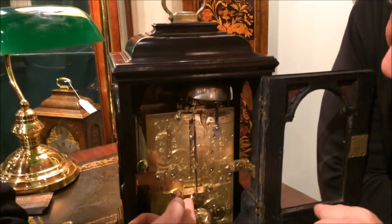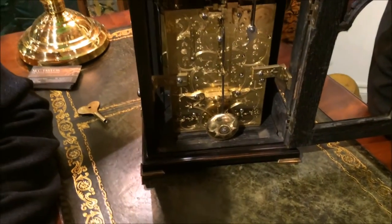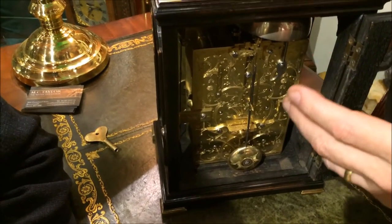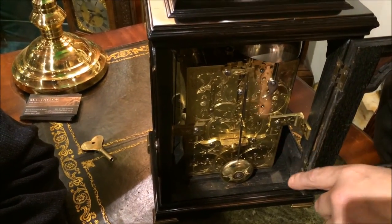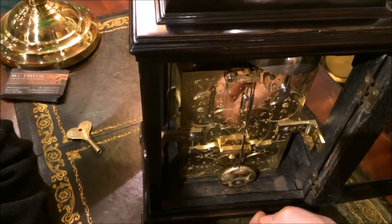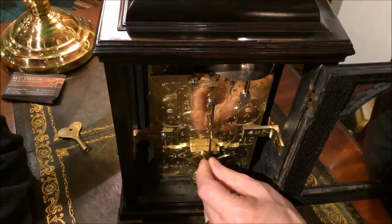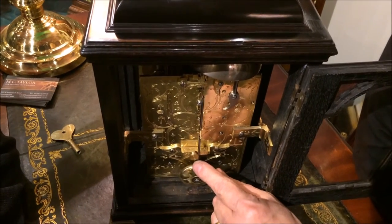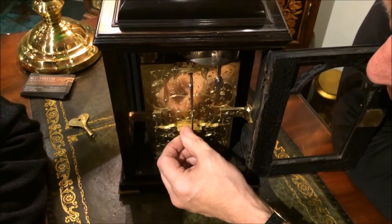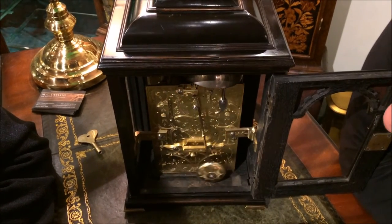What is this, Mark? That wonderful little device. To transport the clock, one usually parts the pendulum, especially with a suspension, so it wouldn't clatter about and cause damage. So this is a locking device. But rather than just a nut that locks the pendulum or a spring, we have here this little weighted block that was swung up into position. That little knob there was unscrewed, the pendulum rod was placed in a groove, and then a nut tightened again — that would hold it firm. When you unlock the pendulum, you just push that down out of the way and then you could start the clock running with its verge escapement.